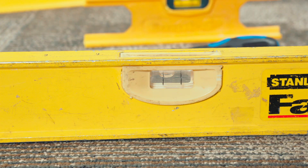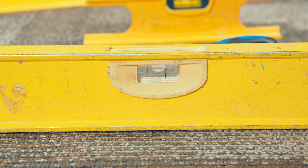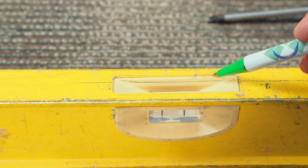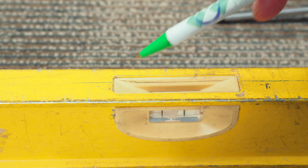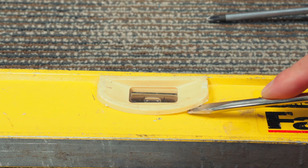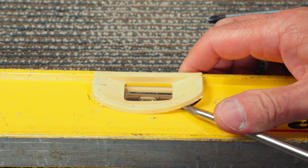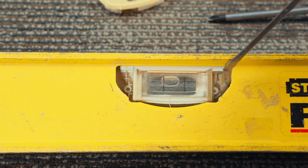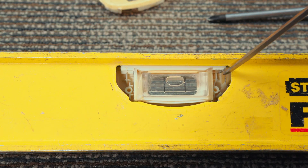Now the other one's not quite as easy. This one looks way off right off the bat — flip it around, yeah, that's not good at all. I can actually see what happened to this one. This thing must have got dropped at some point. See how tight we are up here and then look as it drops down — we have a lot more room down here on this side. So this whole mechanism must have got jolted and moved down. I've already pried this cover off because I'm not worried about scratching it since it already doesn't work. This thing had a bunch of glue in here that I scraped out with a pick — just whatever I needed to do to get that loose.